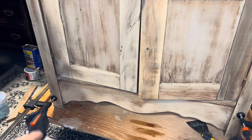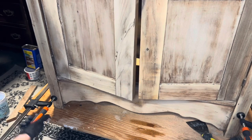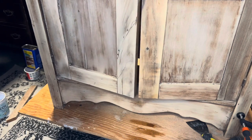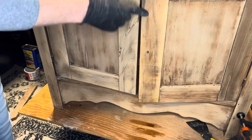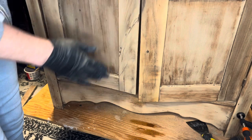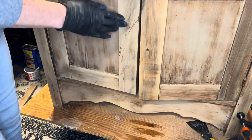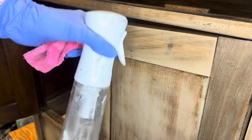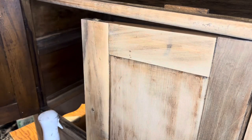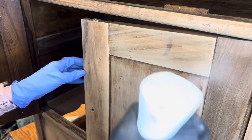These guys have been on overnight so we're going to remove the clamps and then get started putting the white stain on it. You can see the wood is slightly uneven — this is nothing I can sand through to get to a similar color. That's why we're going to do the white stain, just to kind of tone everything together. I'm giving the stain a good shake and I'm also going to spray this down with water to help everything go on more evenly and give a softer finish. I don't want it to look white and cover up the wood grain — I just want it to even things out.